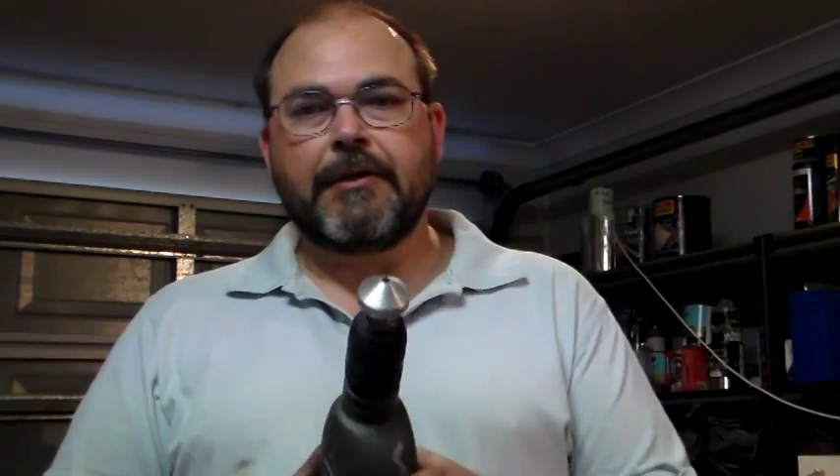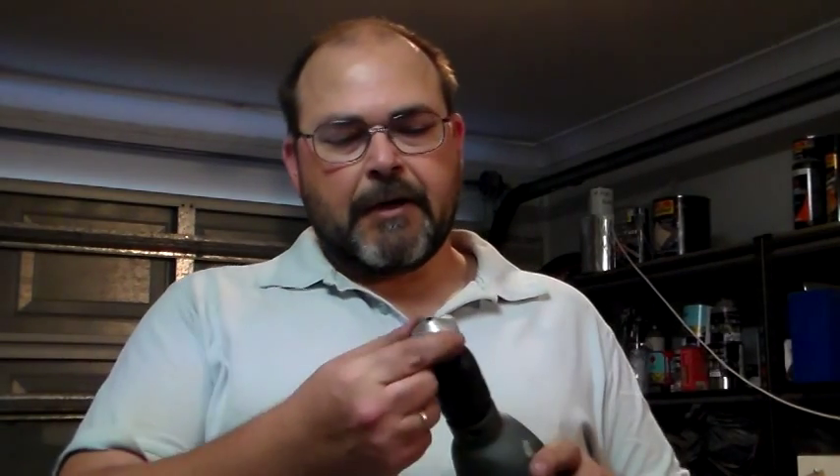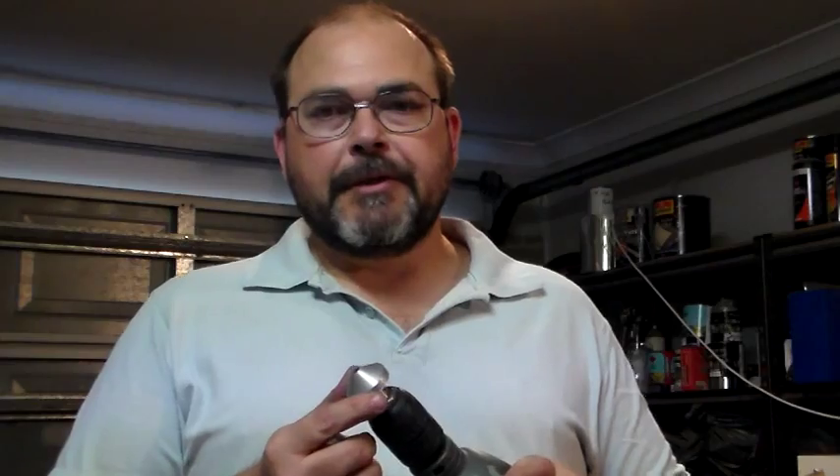So the next thing I want to do now is turn this down to fit into the end of the injection module. This currently sits at about just over 37mm; the internal diameter of the bottom tube there on the injection module is around 27 and a bit millimetres. I had a go at doing it on the drill press the same as I did this, but being flush like this it wasn't working, wasn't happy — so if only for a lathe.